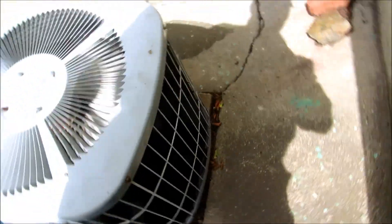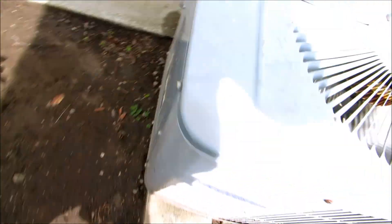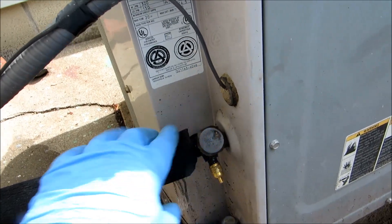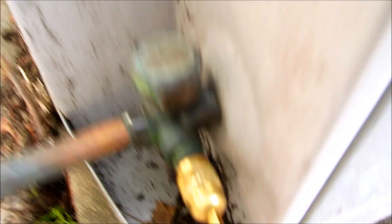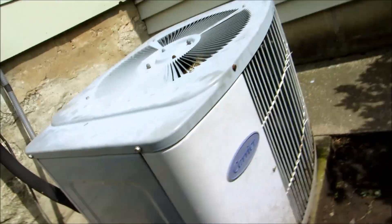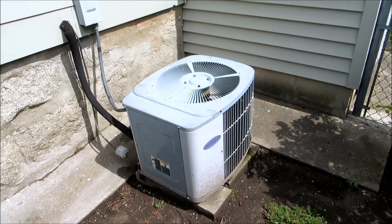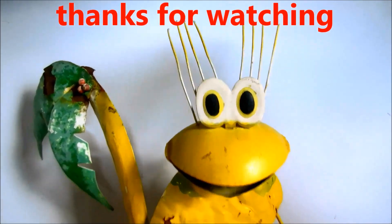Cleaned all inside there - there was a bunch of leaves in there, pulled them all out by hand. It's running good. This valve - I was able to turn it in and the O-ring stopped leaking. I like to put these caps on good when I'm done with Nylog, tighten them up good so it won't leak out and nobody can come play around with them. I told her she needs a new system - it's at the end of its life - but as long as it's running, we'll keep it running for her.